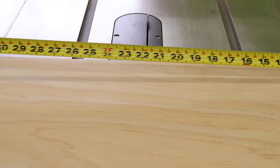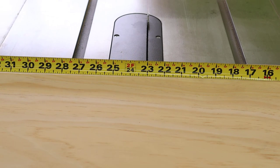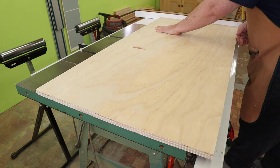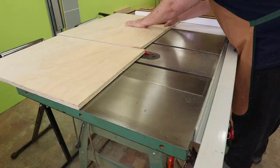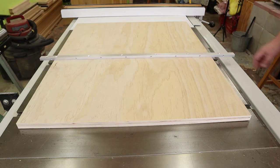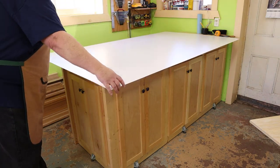I'm going to trim this panel down to 23 inches wide and keep it at 24 inches tall. I like this size for my table saw — it's wide enough to provide a good reference on the fence but not so wide that it's too big and bulky. I also have enough height to use the majority of my bar and always have the sled well referenced in my track. Let's grab a sheet of formica and get it on my assembly table.